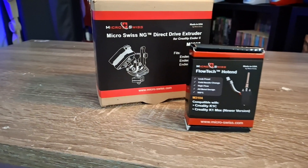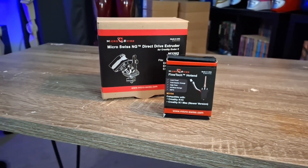Also if you cut the Bowden tube at a slight angle, when it met up with the nozzle there would be a gap — so you'd want to be perfectly straight on that cut. The most common fix was a company called Micro Swiss, super well known for their full metal hot ends. The hot end would go all the way to the very top, so there was no part where the Bowden tube came down into the heat block. It stopped all of those gaps.